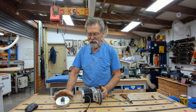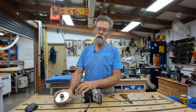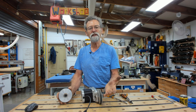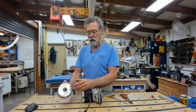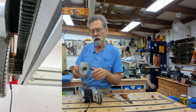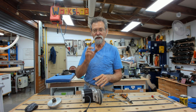Dave here. How are you? If you have an Avid CNC, you may want to think about switching out your pinion gear on the stepper motors. This is something that should be done as regular maintenance every 6 to 12 months. This is running along that rack, and the pinion gear is the thing that ends up wearing, which will give you a little bit of slop. So to keep it accurate, you've got to do this.